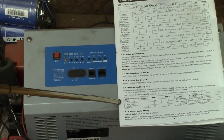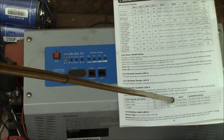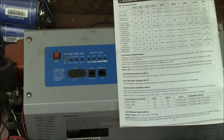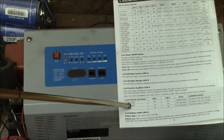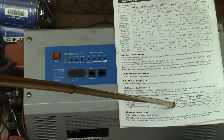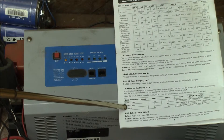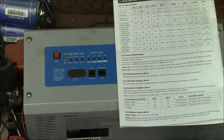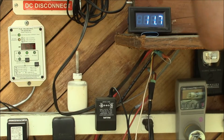They talk about a load capacity of 110 to 129 percent — that would be 1100 to 1290 watts. The alarm will beep and the inverter should shut down after 60 seconds, meaning it should operate for 59 seconds in that overload. Then 130 to 149 percent, the alarm will be on constant and it should operate up to 10 seconds. Between 150 and 200 percent is the maximum overload — it should operate for about a second. I wanted to see if that's true, so let's check that out.